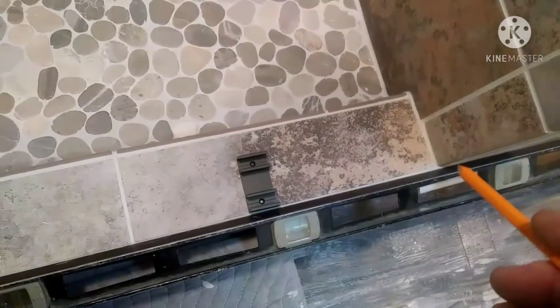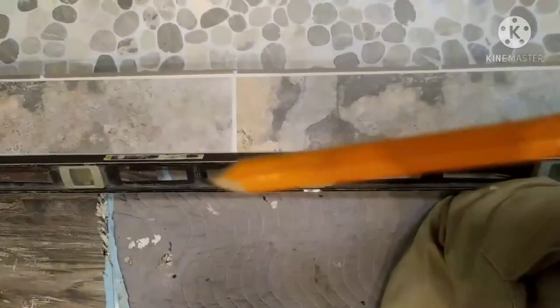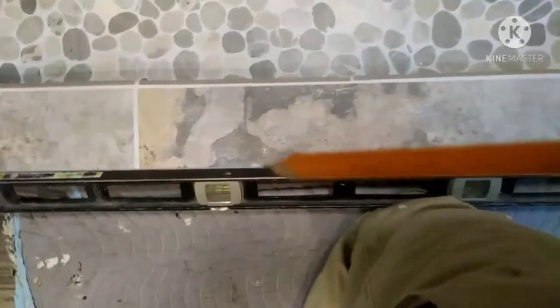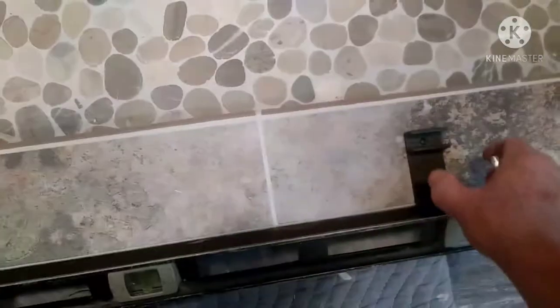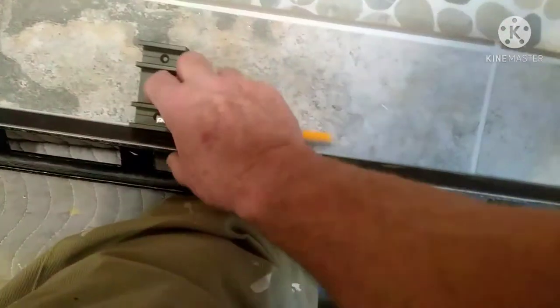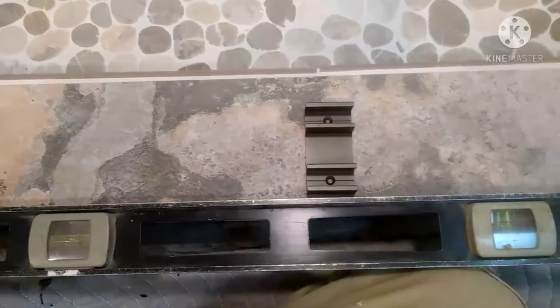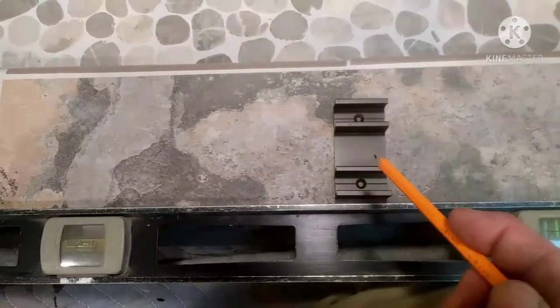There are some adjustments on these doors. I'm checking the curb to make sure it's nice and straight, and then they want you to locate the center where your doors are going to be, with the bracket that goes on the bottom — it doesn't get fastened until after the doors are on. But I'm actually going to start at the top. They want you to start with this piece, find where you want the center to be, then run it up the wall and locate it that way.